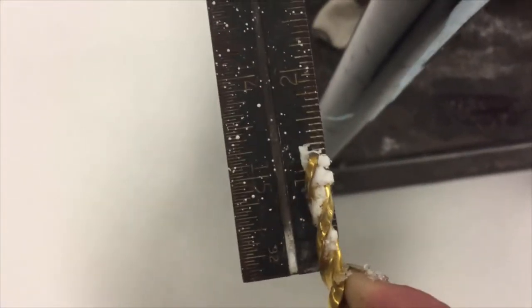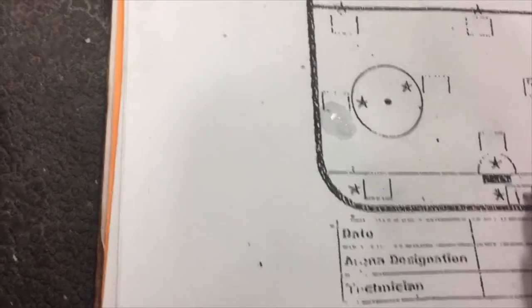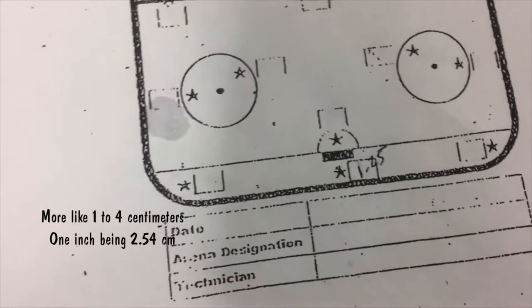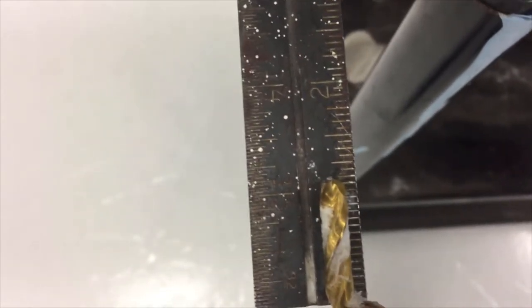Since I have the camera in my hand it's going to be a little different. With this drill, when you hit the concrete, do a tap and put your finger on it to mark the depth. It's nice to have the cart right here so I can just measure right away. I'll call this one an inch and a quarter. I think we should go metric — you'd say 1.25 instead of dealing with all these quarters and halves — but we're going to mark it Imperial. Let's drill down again: a little over an inch, inch and a half.